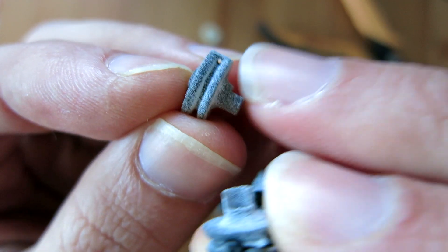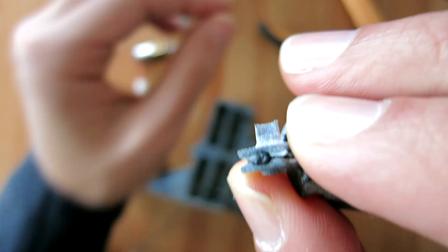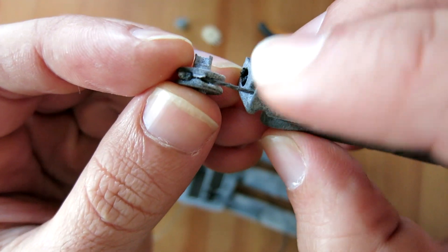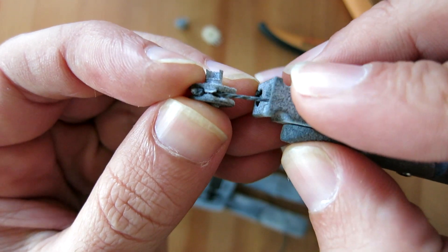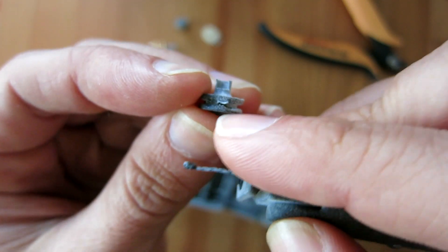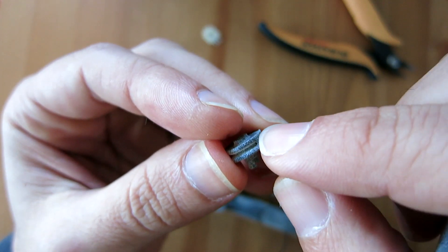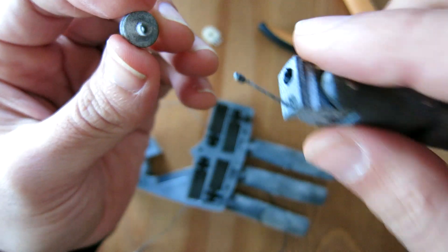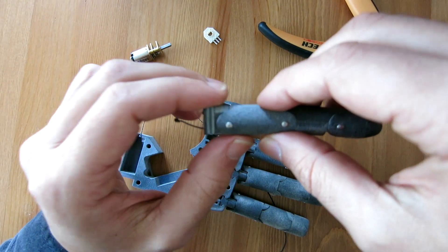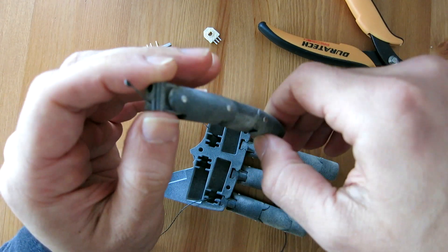Because the surrounding material around the already small hole through the pulley is quite minimal, when a large torque was applied by the motor the knot was pulling on that surrounding material with significant force. After a certain point the material was sheared and the knot pulled straight through. It's a bit of a design error — I haven't designed these pulleys to withstand enough torque, and I'm planning on fixing that very soon.